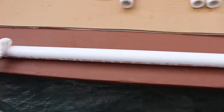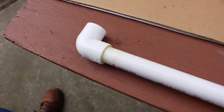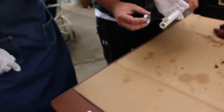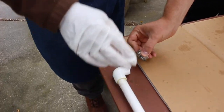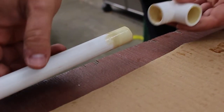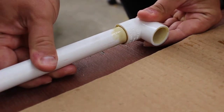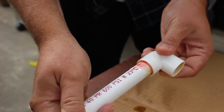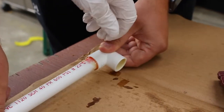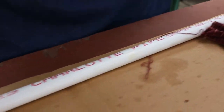Now you can see the elbows on either end of the stick of PVC pipe. You just repeat that process again — primer the edges, add the glue, then insert the elbow. Keep pressing hard down on the elbows, and that's going to allow the frame to sit straight so you don't have anything bending or turning.